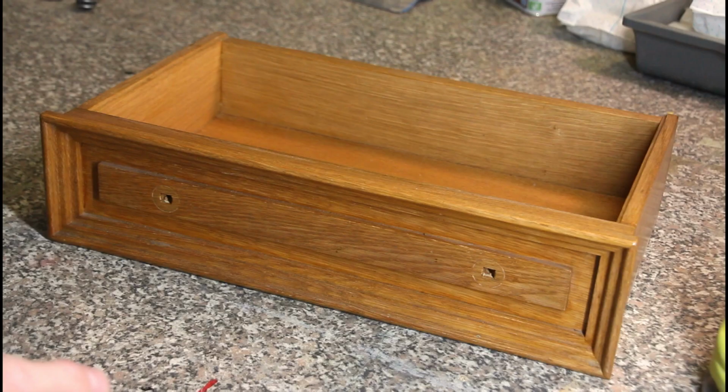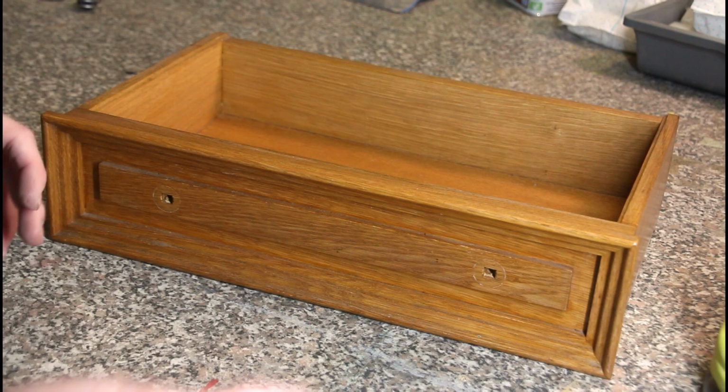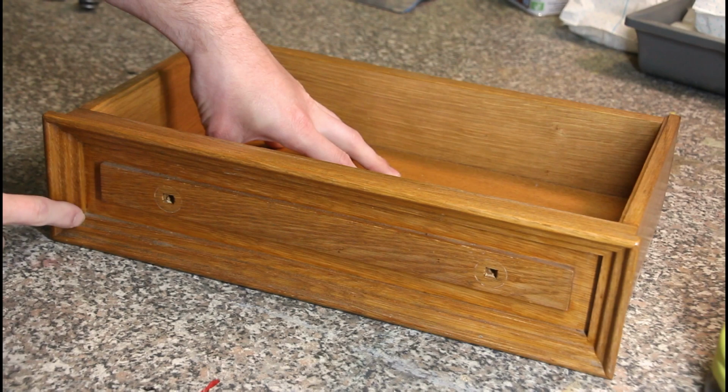And that's it now. It's hard to see on the camera, but you can quite clearly see that the pores of the wood are back open. So sanding a piece of flat wood with an orbital sander is obviously the ideal situation, but just for example, these drawers here and a lot of the cabinet itself have a lot of mouldings in them. And there, it's just tedious work, you're going to have to get in there with sandpaper.